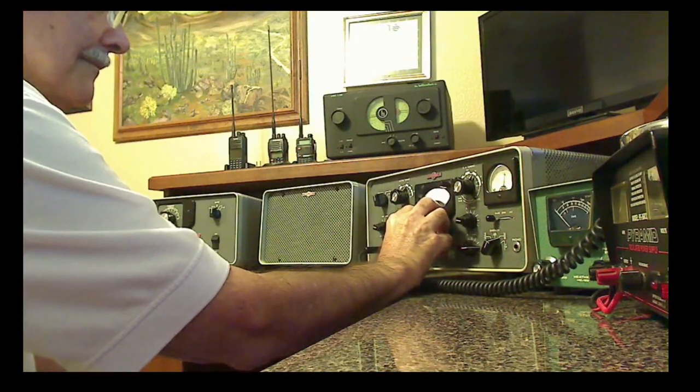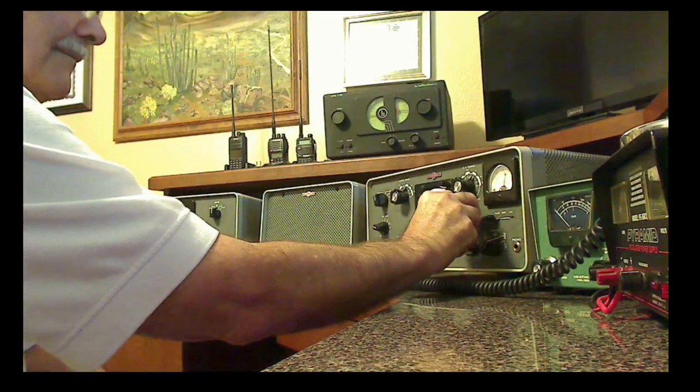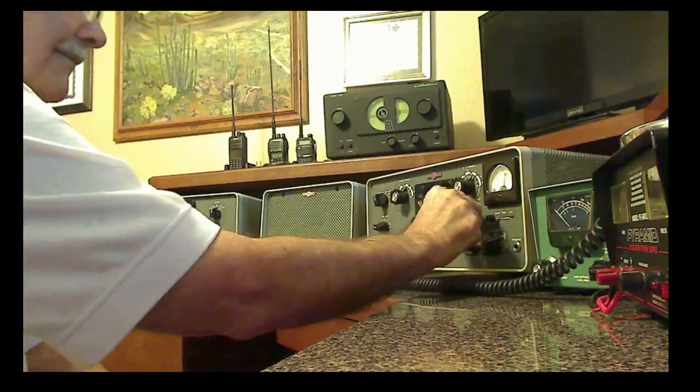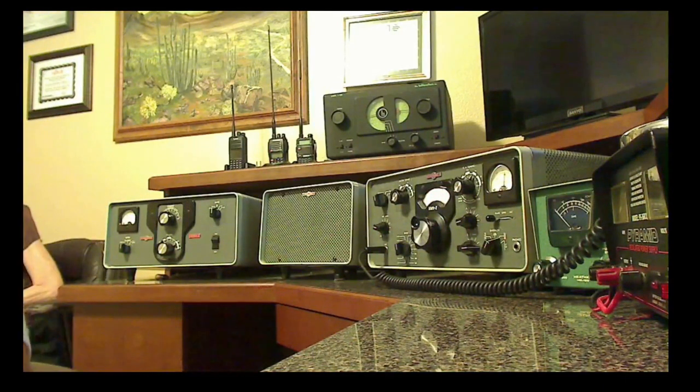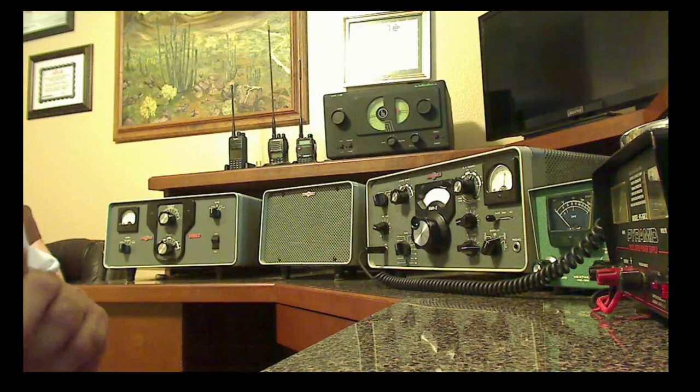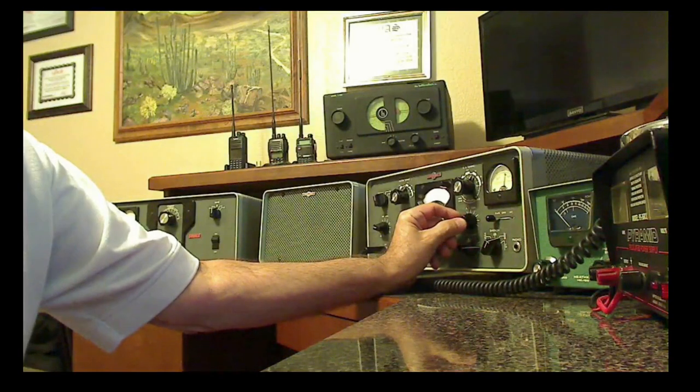And they're in Colorado. My antenna, I've got it locked in this position, so I've been talking into Colorado quite often. My rotator — I had trouble with it, and I thought it was in the rotator, but actually it was in the feed line. So I've got a new feed line but just haven't got it fixed up yet.